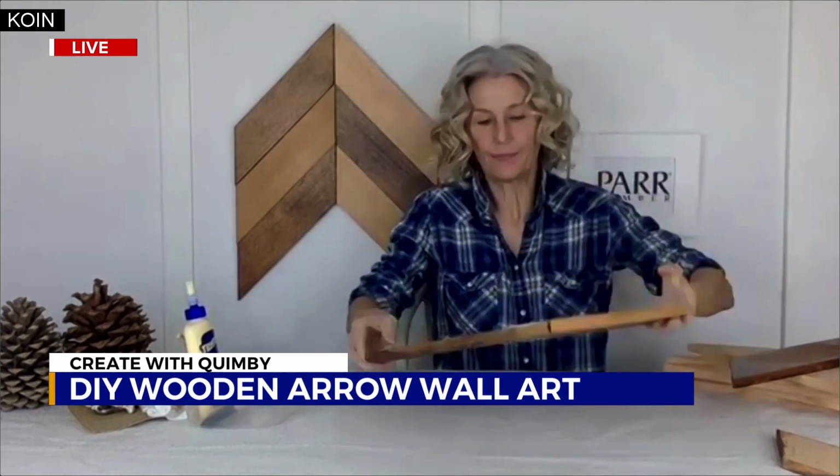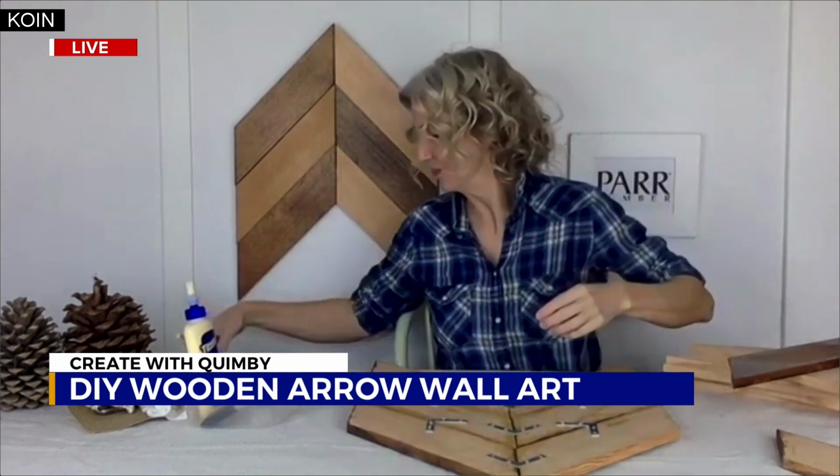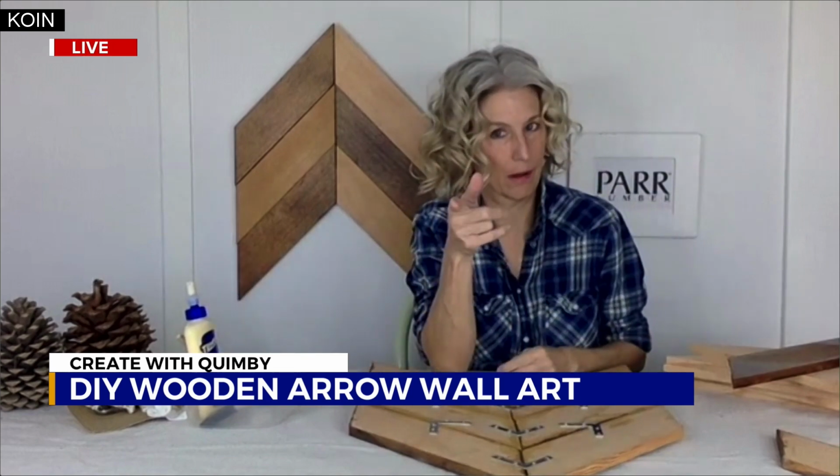And make sure you got screws that are shorter than the width of the wood too. You don't want them popping out the other side, right? Right. Been there, done that, and that's another reason I was saying to go with those 2-inch corner ones, because the screws are thinner than the 1/2 inch of the wood.